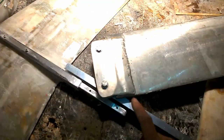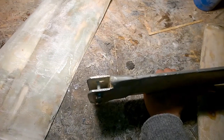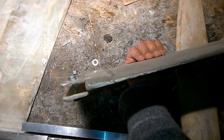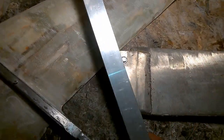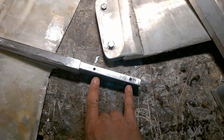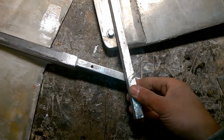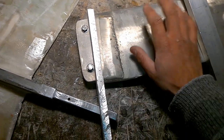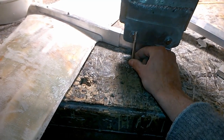Looking awesome — and then the final touch. Actually, I might have to change this up. This is the old system that I'm not too fond of because it just looks kind of ugly and I hacked it together. I put these two pieces of flat plate on there, welded it, then bashed it with a hammer till it fit around the square tube, then bolted through. What I want to do instead is shave this off, weld a flat bar to the bottom, grind it so it's the same curvature as the foil, tap it with screws — nice and sleek, with only two bolts going through the bottom.